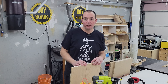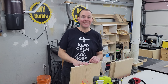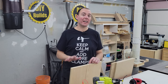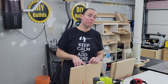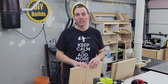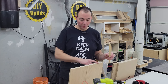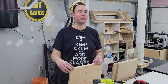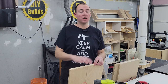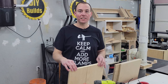We've run into our first issue. This top piece I have cut here is actually a quarter inch too short, and that is not my fault — that is because I'm trying to reuse as much scrap wood as I have around the shop. As this top piece is going to be wrapped in fabric it doesn't really matter what it looks like. To fix this I've got a little piece of wood right here — we're going to glue it on the end, tack it in place with some brad nails, and be good as gold. This project is being painted as well, so using as much scrap wood as you can is always a great idea for projects like this.